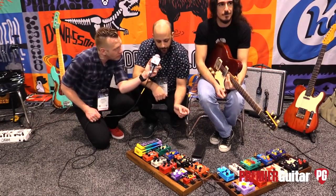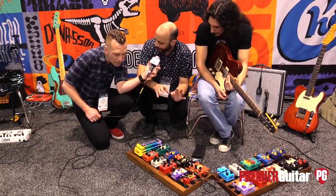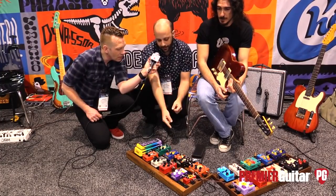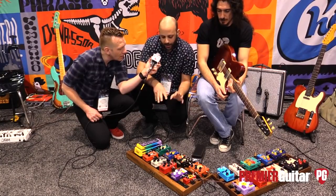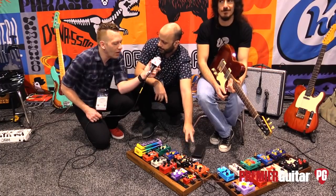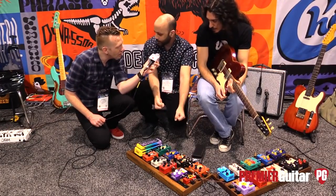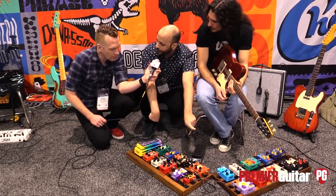The other thing we've done, which we're really happy with, is we've included a couple of dip switches inside the pedal that allow you to break the signal into both overdrives, and the input and output of the pedal actually become breakout points for each pedal with insert cables. So you could be placing anything in between these two overdrives that way. Like an effects loop, basically. Yeah, or you could hook one pedal to the beginning of your looper switcher and the other one on the last side of your looper switcher using Y insert cables.